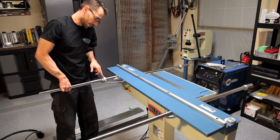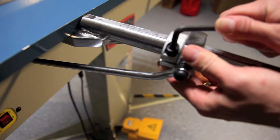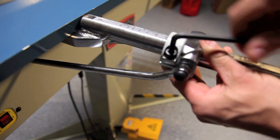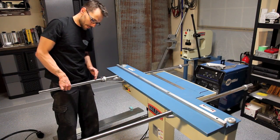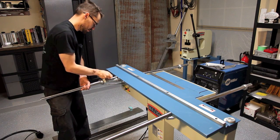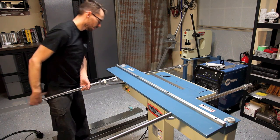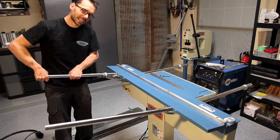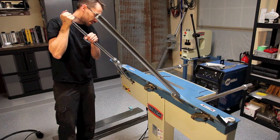And now I've got a stop built in right here, which also comes with the machine. I've got it set — it's got a little allen head screw that you tighten down. It's actually got all the degrees marked here for your bend and the allen screw. Just kind of let that free float, and then I'm going to bend it as far as I can. That's it right there.